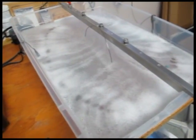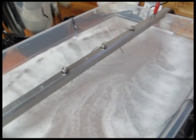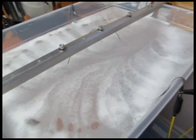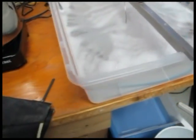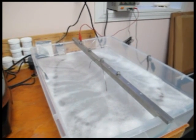The first part is now in the acid bath. I calculated about 18 square inches, which works out to 1.67 amps for 60 minutes to get a one-thousandth of an inch thick anodizing layer. It's hard to see but it is foaming — you can see bubbles around it — and there's good current going through it. We'll let this sit for an hour while I heat up the dye and sealant containers.